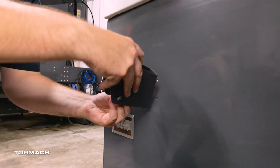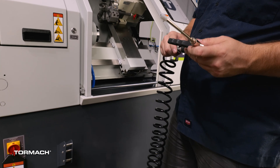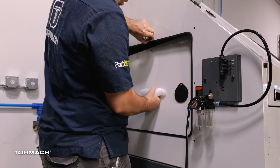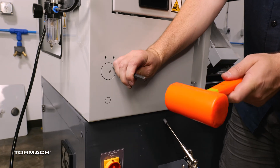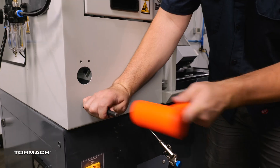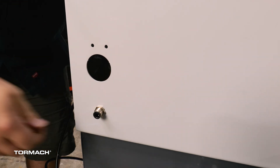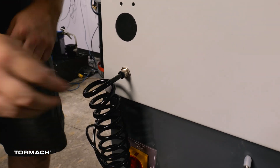The air gun bracket is installed on the front of the lathe with two screws and a hex wrench. Plug the air gun into the included coil cable and nestle it into the holster. Remove the screws securing the left panel and set the screws and panel aside. If the pressure regulator opening isn't removed, knock it out with a hammer and punch — same on the bottom hole. Install the female-to-female air connection here. Make sure to tighten with two wrenches. Install the loose end of the coiled air cable into the push-to-connect fitting.